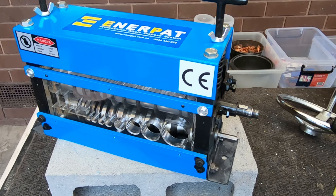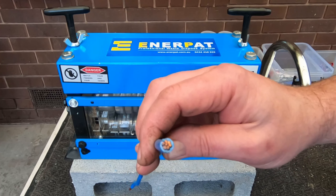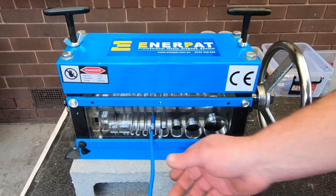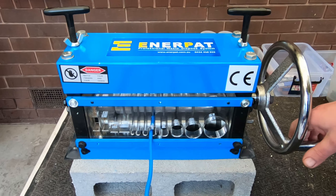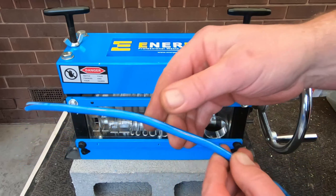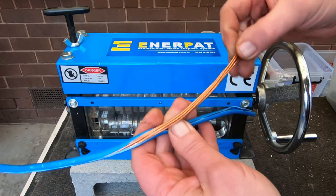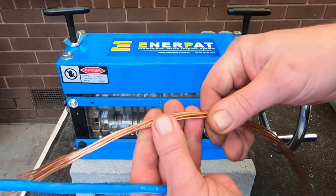I'll try a few easy small pieces — only about a foot long. So that's the core there, it's reasonably good wire to strip. I just want to test one to see whether I've got the right height, otherwise I'll drop it down a little bit or lift it up. There we go — we just want to check that it's cut right through but hasn't cut too much to squash anything. So we're not wearing out the blades as much. And it's pretty much perfect — that's about as easy as you can get.